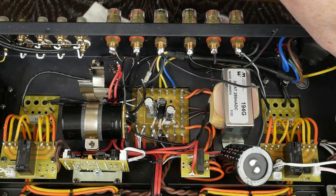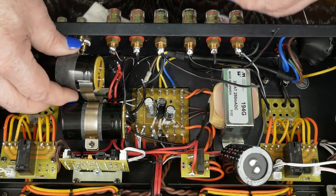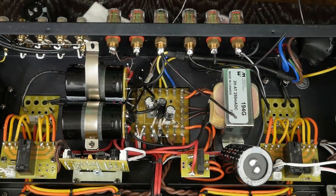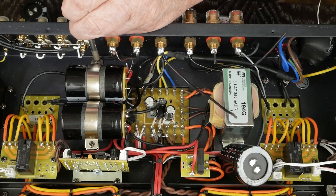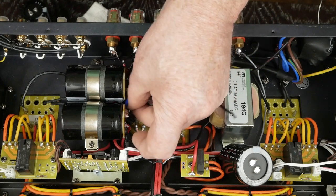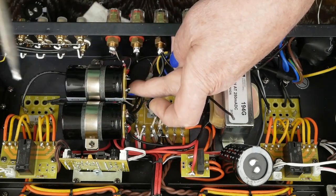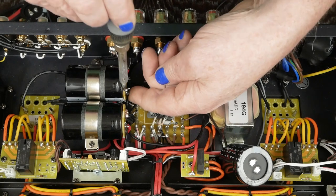The way they wired this really is like star grounding, unlike the R8 and why we had to rewire so much of that amplifier. I think it's going to be easier to bolt this thing down rather than trying to mess with it floating around in here. You don't want to tighten it up super tight where you crush the capacitor — just get it good and snug. So we have this jumper ground and this main ground. I may try to do these more one at a time, and then we can come back and flow some solder over the whole thing when we're done.